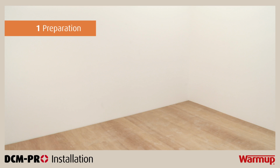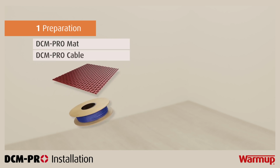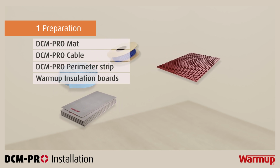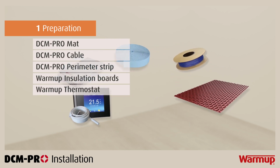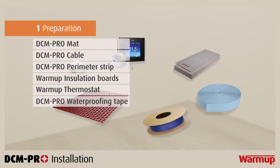You should make sure you have the following components with you before beginning: a DCM-PRO mat, DCM-PRO cable, DCM-PRO perimeter strip, warm-up insulation boards, a warm-up thermostat and floor sensor, and if waterproofing is required, some DCM-PRO waterproofing tape.